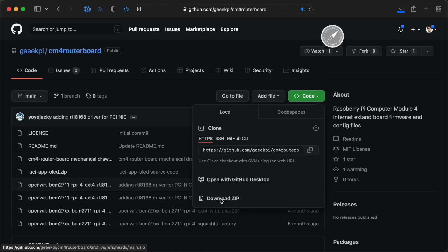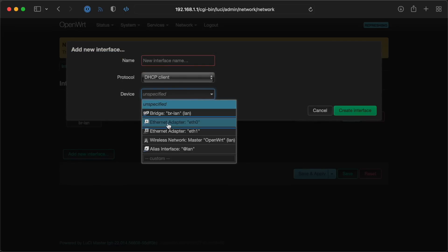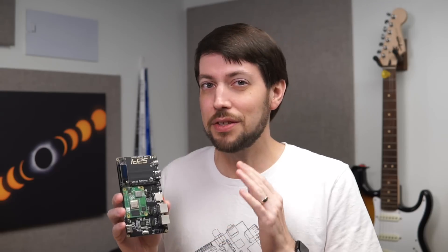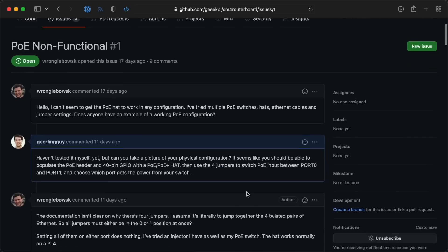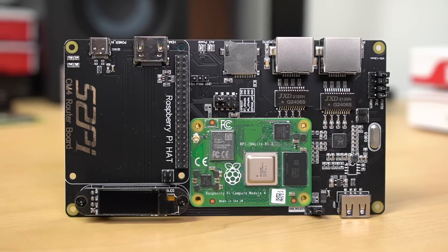Right before I shot this video, 52Pi actually updated their official OpenWrt image, so I grabbed it and flashed it to the board — and what do you know, the driver for the second port is actually included, so I could use both network ports to build a router in OpenWrt. But software bugs aside, the other headline feature that got me excited about this board is the ability to use Power over Ethernet instead of USB to power it. That means you could just have a couple Ethernet cables plugged into it with no need for an extra power supply. These DIP switches should let me choose which port the PoE power goes through, and all I'd need to do is add a PoE hat. In theory. Unfortunately, no amount of installing drivers or recompiling kernels gets past the problem that PoE support on this board is just broken. I tried two different PoE switches on both ports, with two different working PoE hats, and no matter what, I couldn't get this board to power itself using Power over Ethernet. And it's not just me — nobody else I've seen is able to get it working either, so that was a bit disappointing. So if you're okay without PoE, at least not with the version of the board that's out right now, the board makes a decent router otherwise.